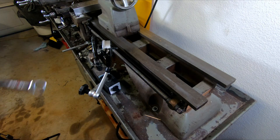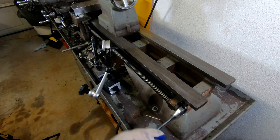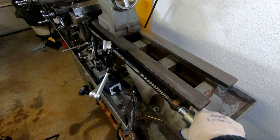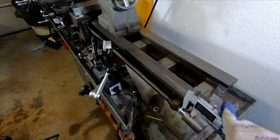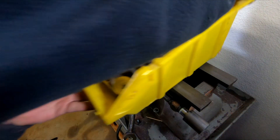We've got some threads on there now, so let's do a preliminary fit. Let's take this nut off — this will be the one we're replacing. You can leave the thrust washers on there, add a spacer. Goes on nice, good fit. So now I need to figure out how wide that midsection needs to be, where the shoulder needs to be, and how long the shaft needs to be and what size.